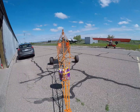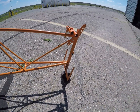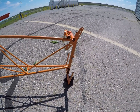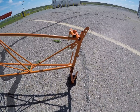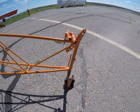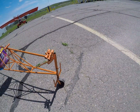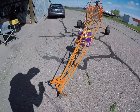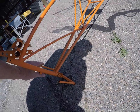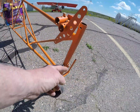Starting at the back — one of the first things you might notice is a tail wheel. I got this idea from Denny Saline; he's got a tail wheel very similar to this on his Legal Eagle. The tubing sizes and wall thickness back here are all 0.028 wall except for the vertical that goes up into the vertical shaft — that's 0.035. There's a little spring down there, and that's my third spring trying to get one that seems about right. I've got a stop over here to keep it from falling out.